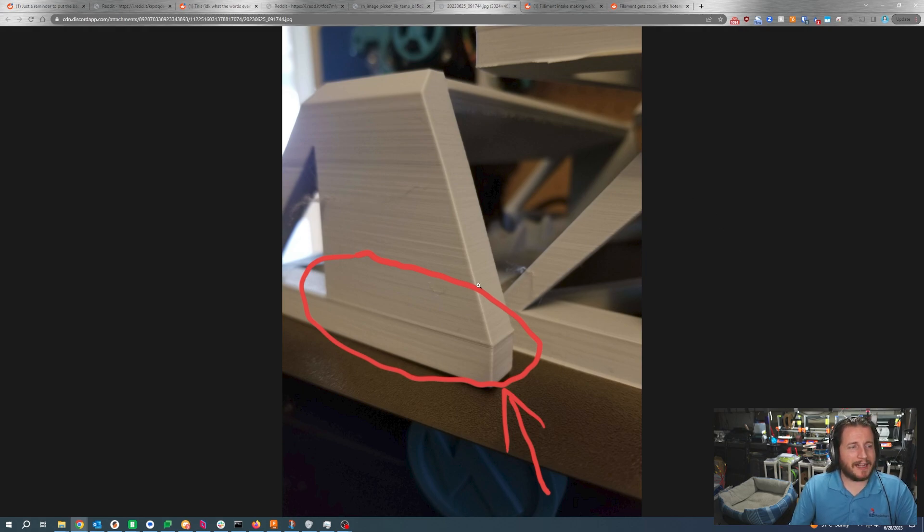We want to make sure that we are getting 100 millimeters when you are asking for 100 millimeters. On the Sovol SV06 and the Plus, make sure the extruder bolt that applies pressure is tight enough on the filament — it is common in the regular SV06 that it won't be tight enough and the filament won't always grab. Let's start there before checking our steps per millimeter to make sure we're not just randomly grinding filament. In a case like this, I'm pushing for overextrusion — I think that's what it might be because otherwise the print actually looks pretty good.